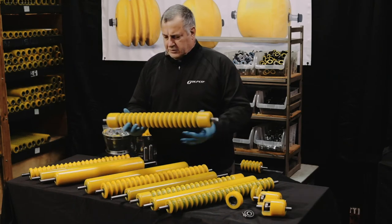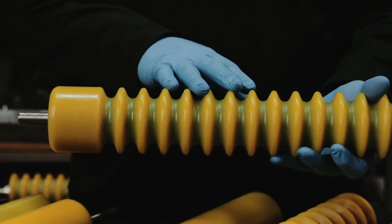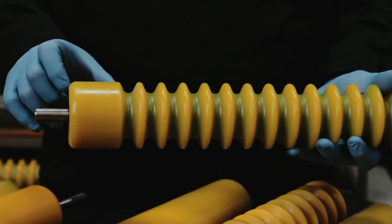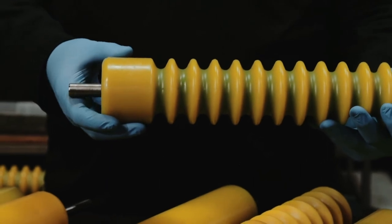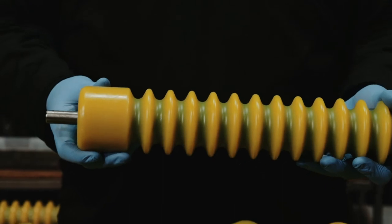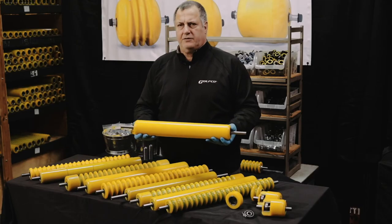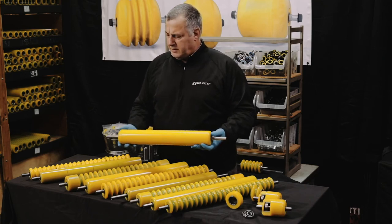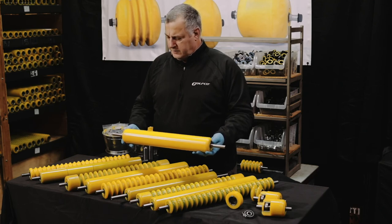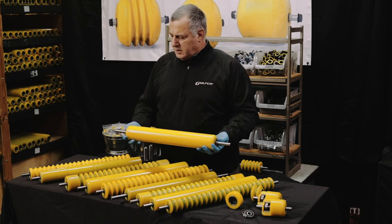This is our special anti-shadowing roller in a three-inch diameter. It has the same groove pattern — one-inch spacing between the crests of the grooves, and a two-and-a-half-inch wide flat surface spacing. You would install these on the front of the back reels. This is the shorter roller we suggest on the back, behind the shouldered roller on the back reels. This is a 19.45 inch body, so three inches shorter than the front reels would have.